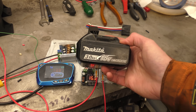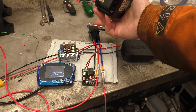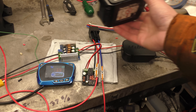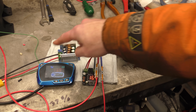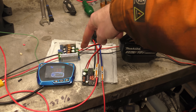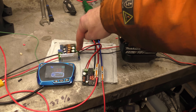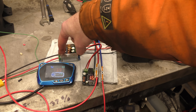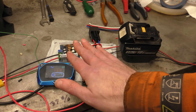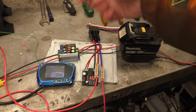We can't use too high a voltage to run the system because we don't want to overdrive our relay. And obviously people are wondering: why not just run it from the 12 volt or 14 volt side? The point is, no matter what voltage you put into this side — up to a given voltage for this controller — you will always get 14 out of this side. So even as the battery got lower and lower, it would still output 14, and then just stop. That's why we have to go on the battery side to sense the battery voltage and cut the power that way.